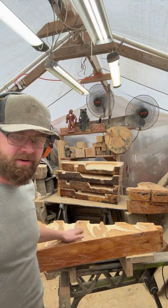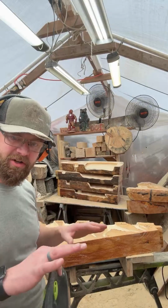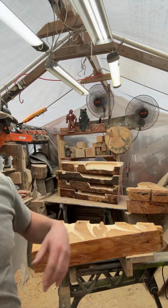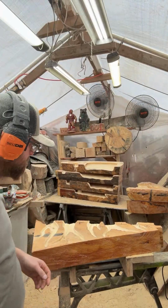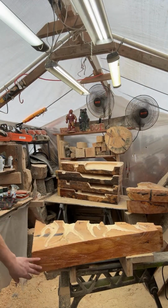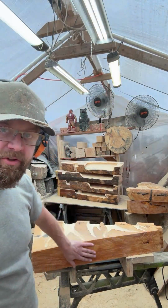Right now I'm working on number 15, just cleaning it up, trying to figure out how I'm going to get LEDs in this, because this will be the most shallow stair tread as far as carving goes. And then those two off to the side have to get cleaned up today as well. I've got a few others already in the other shop sitting aside waiting for epoxy. But these still have to get the carving done. These have to get a wooden filler plate made for the back because this gets routed out. This is where all the wiring is going to be for those LEDs.